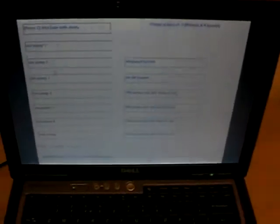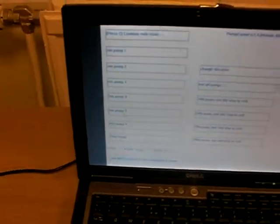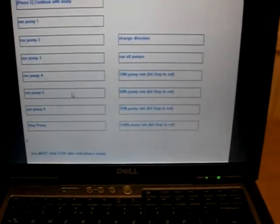And we'll reverse the direction in which all the pumps are being run — Change Direction. The little arrow appears down there. Press the stop button, which equates to the enter key. Now instead of running all the pumps, we'll simply run pump 5 using the pump 5 option. Another thing I forgot to mention: if you have to restart a pump, you have to restart your software. To do that, you have to click Shift, Control, and Alt at the same time. On the screen it says 'would you like to abort?' and we'll say yes. Let's run the software again. We'll run pump 5 — it's working now.